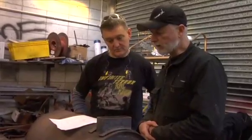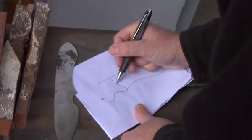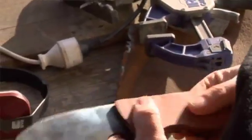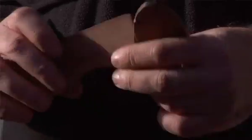To put the handle onto the knife, we've got a pattern. We go back to the original pattern, look at the shape, and make sure you've figured out the kind of handle you want to use. Draw that up and cut it to shape. Get a feel for how that feels when you assemble it — is it too wide, is it close, how does the curvature work in your hand? Particularly along the edges, you want to try to make sure you've got those nicely chamfered and smoothed off.